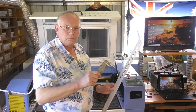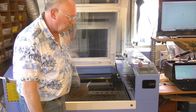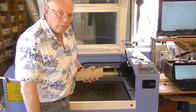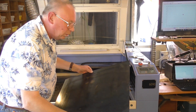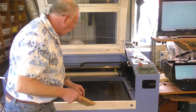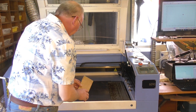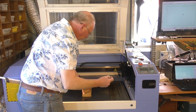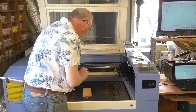I'm just going to draw a simple measured square in the laser cutter and we'll start cutting. We need this piece of oak to stay at a constant position on our table. I use a little trick — this is a sheet of just black mild steel, very flat. A lot of any condensate that comes off attaches itself to this or condenses back on this metal, so it doesn't block up your filters. I put this on here and then use fairly strong magnets to hold it in exactly the same position so it's not going to move.